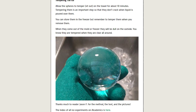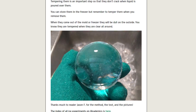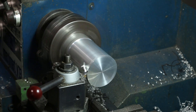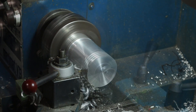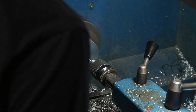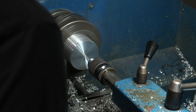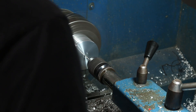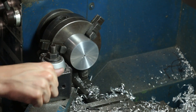If you really want to step up your game, we'll include a link below to some articles on how you can pretty easily make clear ice. We did some quick OD turning and grooving on the manual lathe, both for decoration but also to help increase the surface area of the aluminum part. We need that thermal conductivity property of aluminum to help wick away and melt the section of the ice cube that we don't want. Aluminum is an excellent thermal conductor — it's incredible how cold just one cube will make our aluminum object.